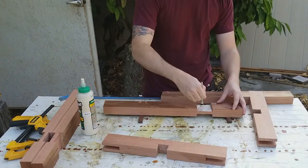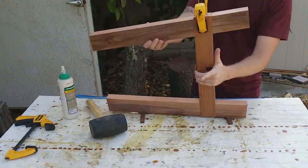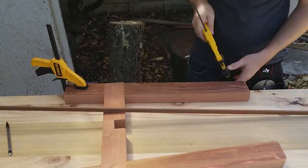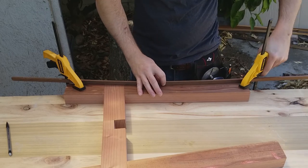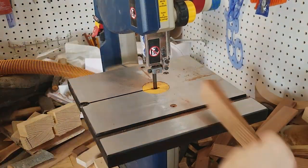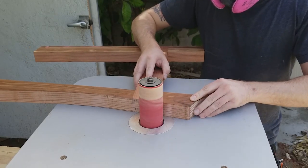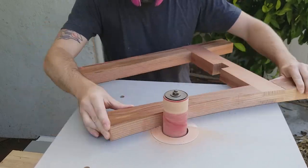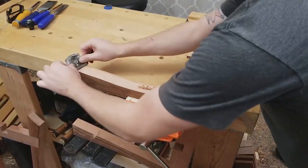Now that all the joinery was finished, I glued it up in two sub-assemblies using Titebond 3, since it was an outdoor project. I applied one clamp to each bridle joint and waited for it to dry. I drew a small curve at the top of the leg freehand, then attached some clamps and bent a piece of wood to trace the long curve. Then I cut those curves on the band saw. I smoothed out the curves with the oscillating spindle sander, and then decided to use a spokeshave instead, because it is quicker, there's no sawdust, and it leaves a smoother surface.